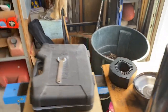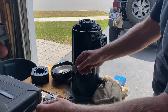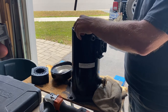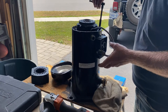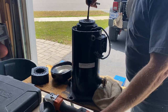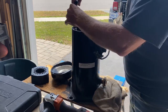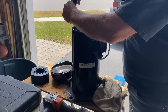I've loosened the bolts already. There are four bolts holding the top of this scroll down. I'll pull this top off and show you the scroll. Hopefully you've done a little research and understand how the scroll works — two scrolls, one stationary and one orbiting. The top one is stationary; underneath there's another scroll that orbits. It doesn't rotate, it orbits — similar to how an orbiting sander works.